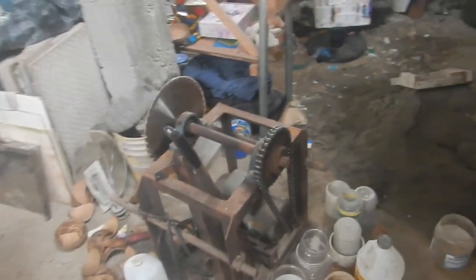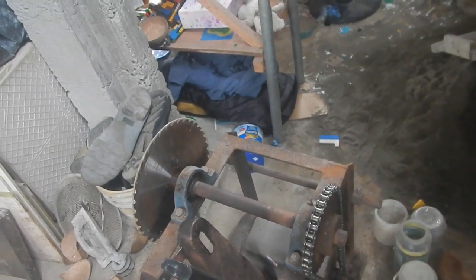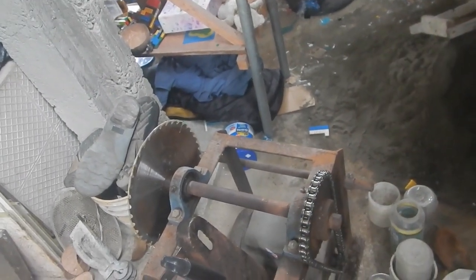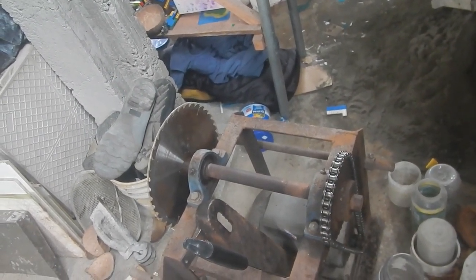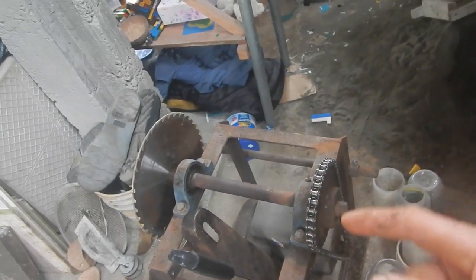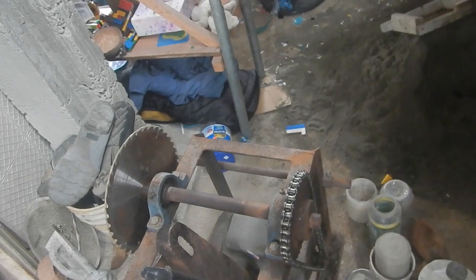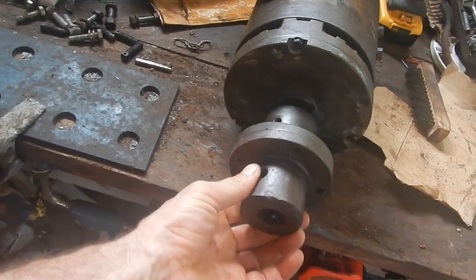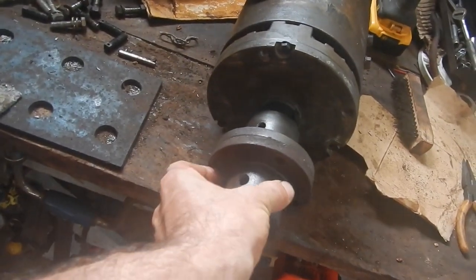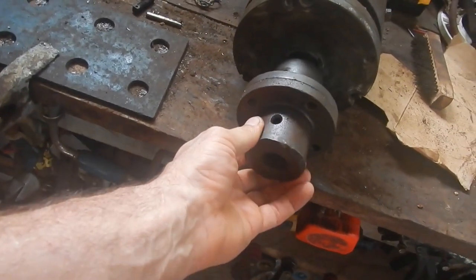I think I want to use a direct drive — connect the motor directly to the shaft so there's no gearing, because that just takes out a whole chunk of moving parts. Let me start messing with this and see what's going to be involved in connecting the motor directly to the end here. I have this on here, and this bolts onto there because this was connected to a boat with a shaft going out to a propeller.